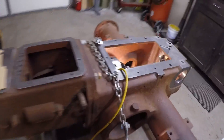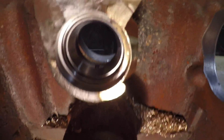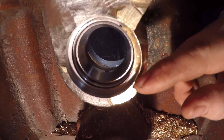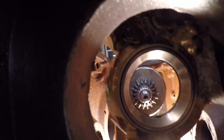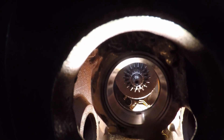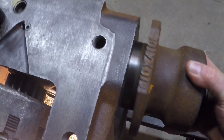After the second round of machining I think I'm finally where I need to be — I'm pretty confident with it. I've got the live power shaft with the clutch in here ready to do another test fit. I had to come in just about to the edge of the counter bore, but the way the 45-degree slope cones out and increases my wall thickness, this really shouldn't be a problem. Looking in through the back of the case, I can still see a good quarter-inch wall thickness there, so all in all I'm pretty happy with it.